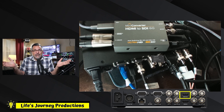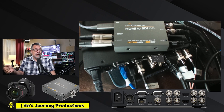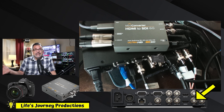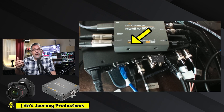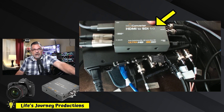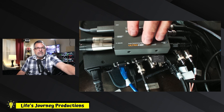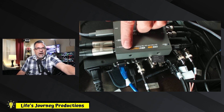To recap: you have HDMI out to monitor, SDI out for monitoring, HDMI in for recording, and SDI in. If you want to come out of a camera HDMI and hook up to the SDI input — whether the older HyperDeck Mini or the new HyperDeck Studio HD Plus — you'll need to convert your HDMI to SDI. If you can record 4K out of the clean HDMI of your camera at up to 30fps at 2K or 4K on your HyperDeck, make sure you use a 6G converter to send that 4K signal.